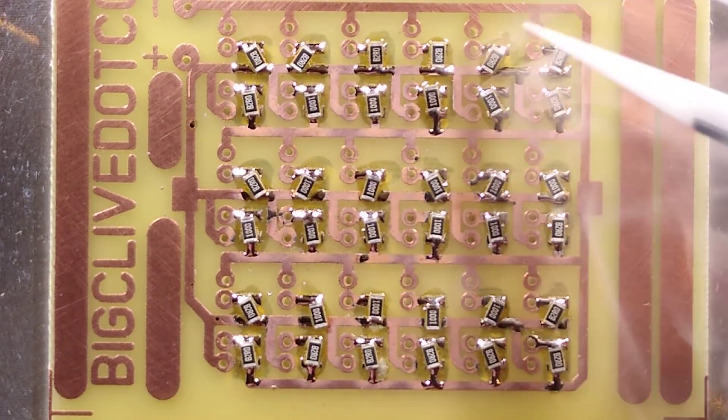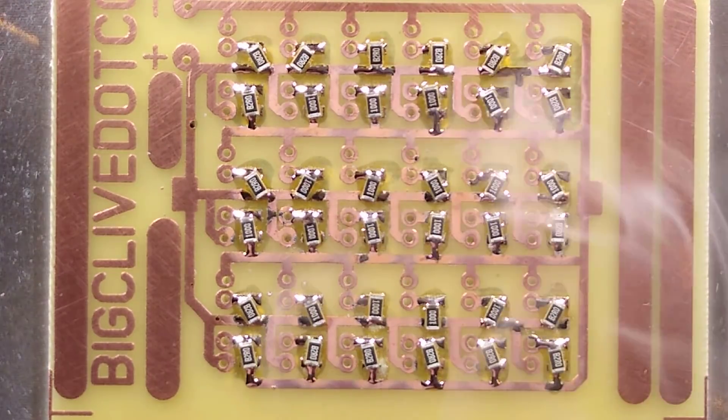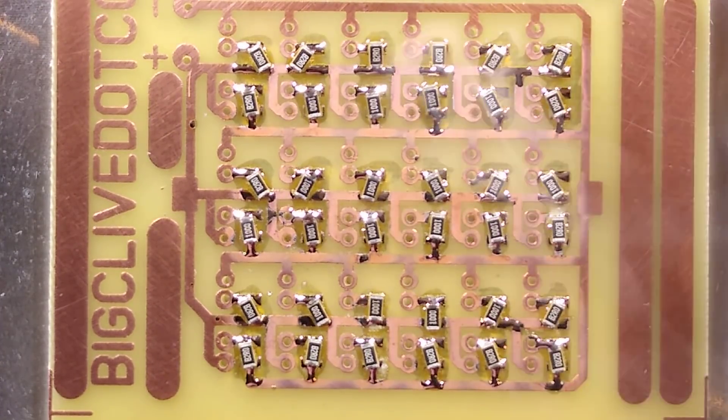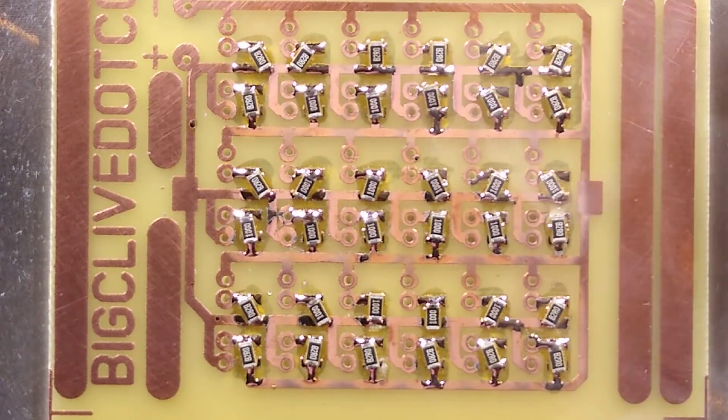It's lying horribly. That's awful. This is where the solder resist would have helped, because the solder paste has gone everywhere and it's now aligned all the resistors in a wonky style. But not to worry - it'll still work. I shall lift that off now and let it cool down and check the solder has all flowed. I'll let you know how that went.